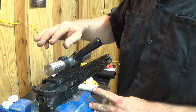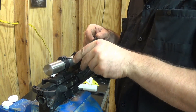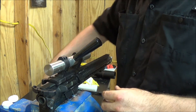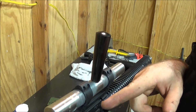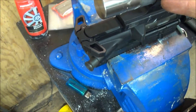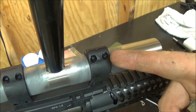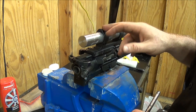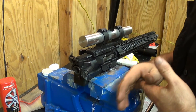Real quick — once you've done this and gotten that initial grit out, you can go ahead and tighten up your screws to get a little better fit. I don't know if you can see the color difference — see how it's a dark gray right here and a light gray right here? That's the actual metal, or the finish, being taken away off the ring. So it is working, smoothing itself out. As you go along, tighten your rings back up.